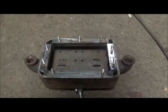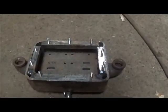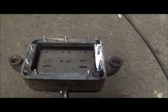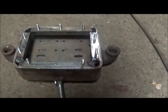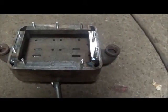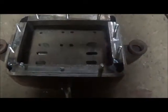Okay folks, I am putting the top on — drilled and tapped it. I wanted to run studs because, to me, bolts just don't look right on it. Being an old engine, I may use square nuts. But I didn't get the hole deep enough and these studs are just grade five, and I messed around and broke one off. So we're going to try to get it out. I know it's in there tight, but we'll try to weld it up and get it out.